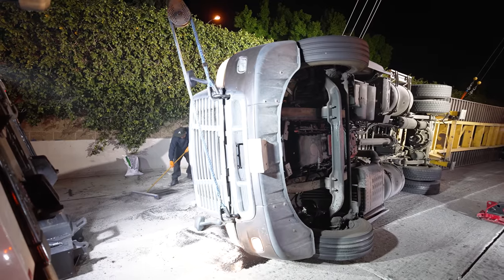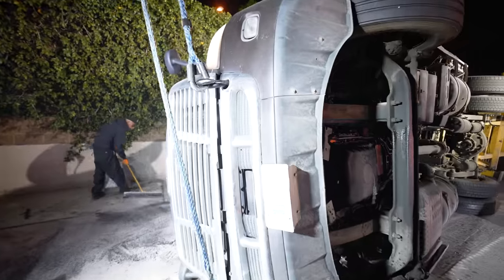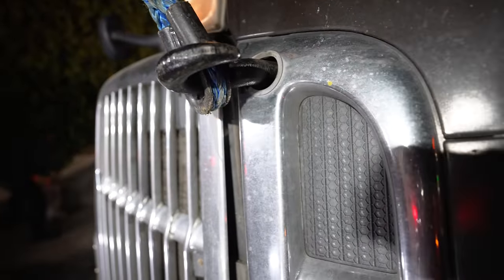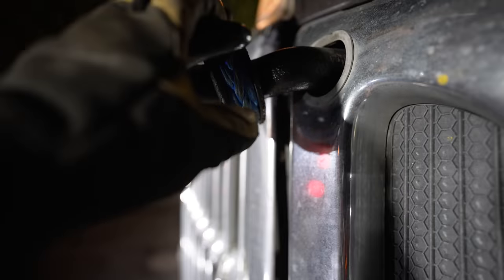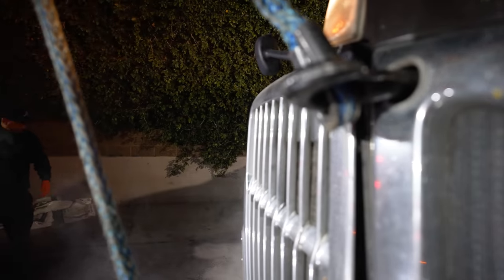There's good. Let me push these back a little bit. Now, while I love this method, one of my buddies, Sean, brought up a good point I hadn't thought of before: these pins are not rated for side loading like this. They're called pull pins. But I figure you got the rotators handling the container, all that weight, and because I have an equalizer thing, each pin has exactly 50% of the force of the front of the tractor.